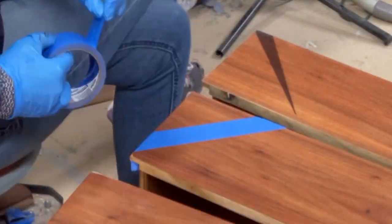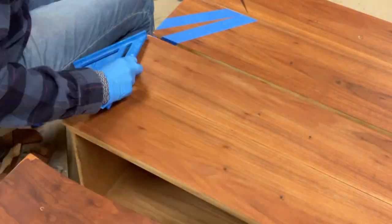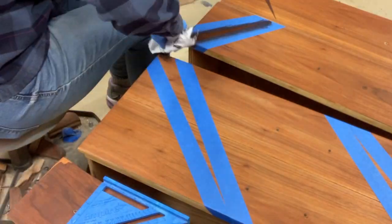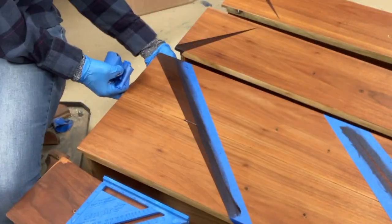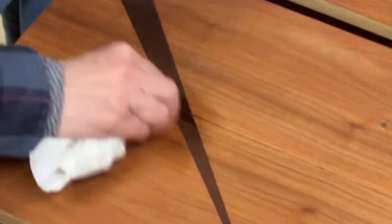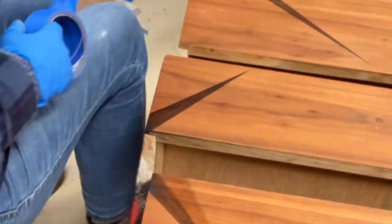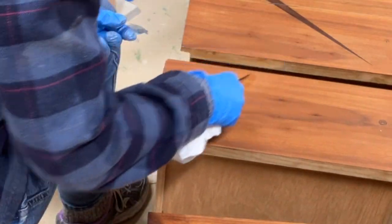You can do so many things with stain and tape. I'm using Scotch Blue painter's tape — you have to get it nice and tight on the wood, and even then you might get some bleed-through. When that happens, use mineral spirits to clean it up, then come back with a small brush and some stain to touch it up. It takes patience and might not work the first time, but don't panic — you can always fix it. The color stain you choose depends on your needs; I needed a dark stain to cover the wood filler.